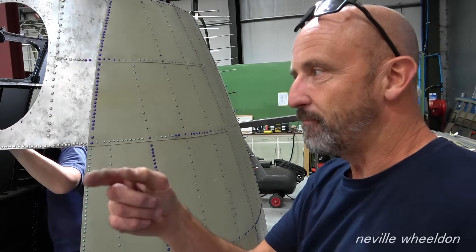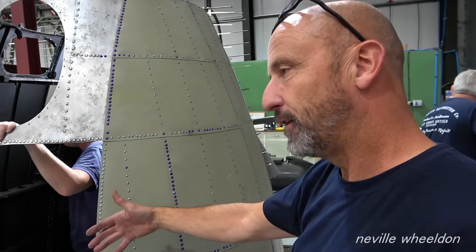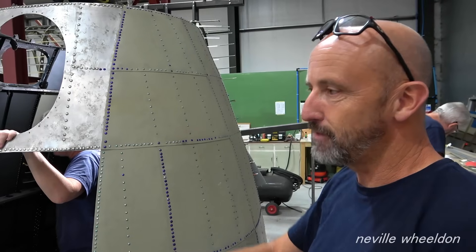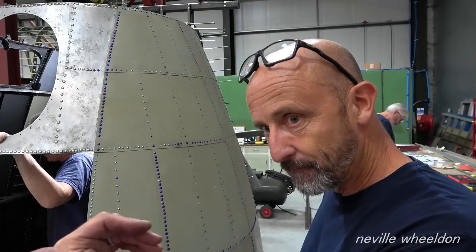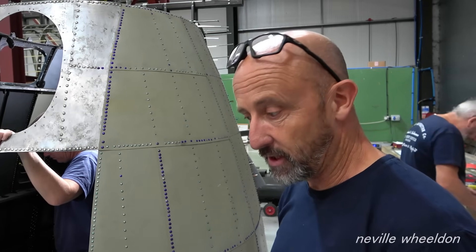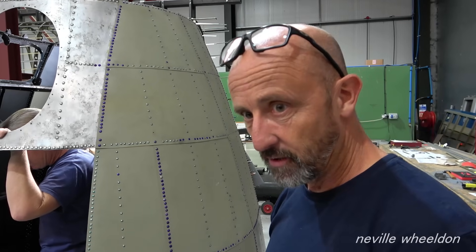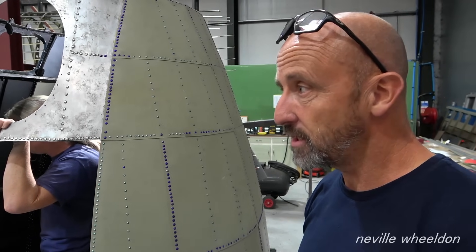The only thing I've got at the minute, which is in the stripping bath, is there's a shroud that runs over the top of the turret — it's like a closure panel sort of thing. I found it the other day, it was on top of the racking in bubble wrap, massive thing. So I've had to de-rivet it down the arc, split it in half, and throw it in the paint stripping bath — it's like a massive kettle. Brilliant stuff — so none of this rubbing paste on and waiting for it to go off and scrubbing it. You just lift the lid, plop it in, shut the lid, leave it for 20 minutes to half an hour and you can just take it out. Is it a dangerous chemical? No, I put gloves on anyway, but it's alright.